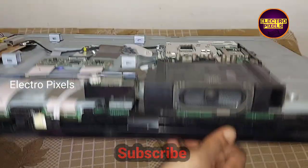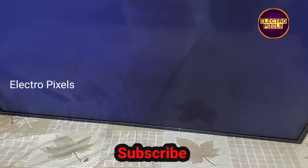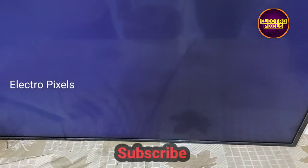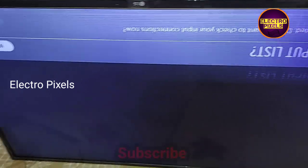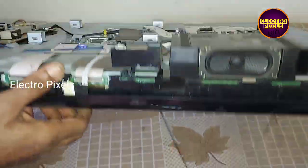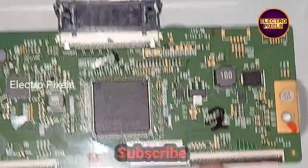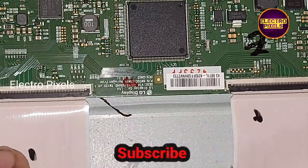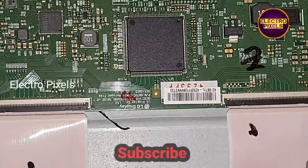Now we open the back cover of the TV. You can see the complaint — the picture started flickering and there is a double image on the half portion of the screen. It's a 4K LED TV. You can see it's an LG T-con board. These are the gate signals from the left side and the right side, and the complaint may be due to shorting in gate signals on either side. If both sides are short, it is not repairable.